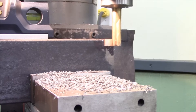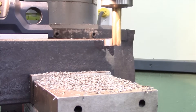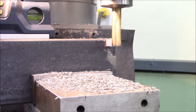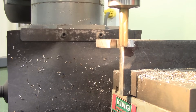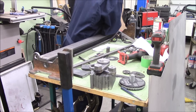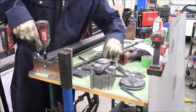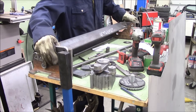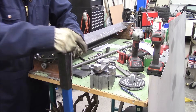I needed to have some space in the base. We're on the milling machine cutting a nice groove — it did leave a little bit of a rounded corner in there but it'll be fine. Reassembling the whole thing and adding in the little rings that kind of act as bushings. This stuff is getting heavy now — holy smokes, I don't know if I'm going to be able to lift this when it's all completed.